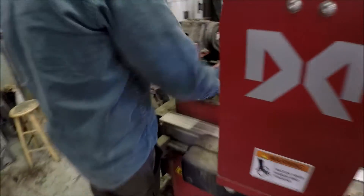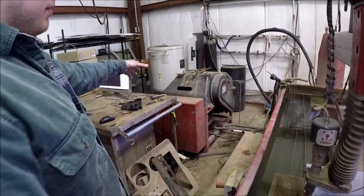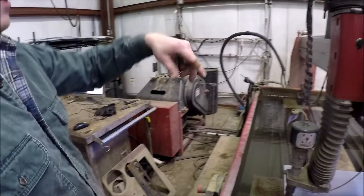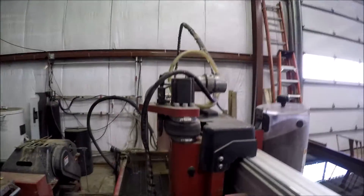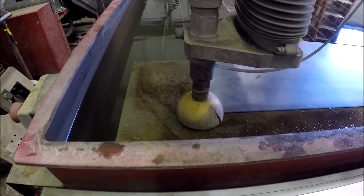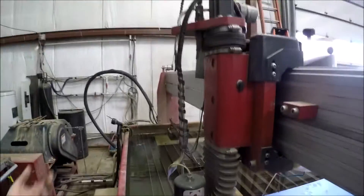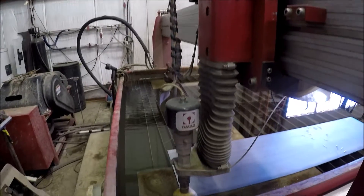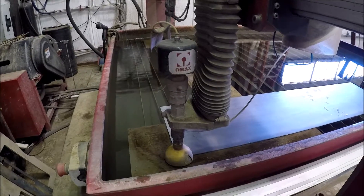The core function of the machine is a 20-horsepower pump pressurizing water through very small tubing. It comes up to the table, over the boom, and down at the end is an 11-thousandths diameter orifice. It takes water from piping about an eighth inch in diameter and forces it through that orifice — they call it a diamond jewel, so it lasts a long time and doesn't wear.